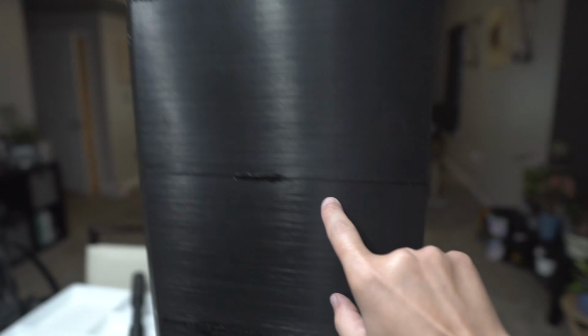This was my first time plastic welding anything 3D printed, and as you can see, I did it a little bit differently from one side to the other. I left a little line there to see how strong that bond would be, and believe me, I made a lot of mistakes and learned a lot from this print. Something I'm going to use on my next prints is to always plastic weld the whole line to create that strong bond.